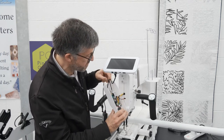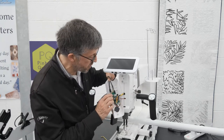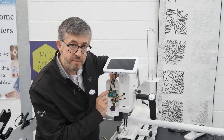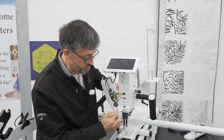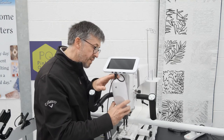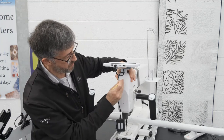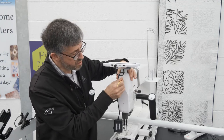We can now put this nose cone back in place, but there are a couple of things to be very careful of. Firstly, these two cables can get trapped very easily when we put the cone back. Secondly, there is an earthing cable at the top, and the bolt that holds the nose cone in place has to go over the top of that earth cable. Making sure that earth cable is in place, there's a little nodule at the bottom which fits into this slot. Try not to pull the cables — it goes in at the bottom first, then the top pushes in, and I'm watching to make sure these two cables fit into the slot at the top of the nose cone so they don't get trapped. Now I can re-tighten this — it doesn't need to be tight at all; it's a plastic component, just tight enough to hold it firmly in place.